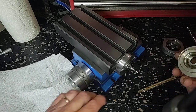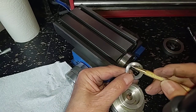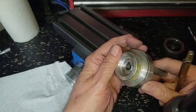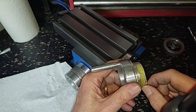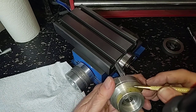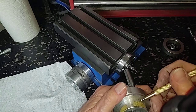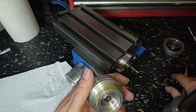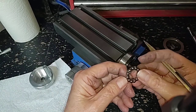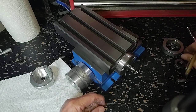There's a bearing race here. What I'll have to do to make this work properly is put a shim on this surface right here to pull this out. The friction element, by the way, is this piece of tape. If I keep this one, I'll drill a small hole about here, getting into the web as close as possible. I'll drill a small hole, drop in a small spring and a ball bearing, take this tape off, and that'll give me all the friction I'll need.